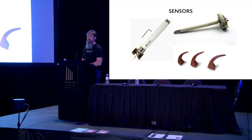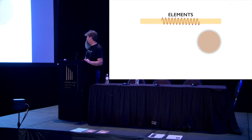And then, of course, we have cones. And cones, as a sensor, are extremely important, even when you're doing computer kilns. Because the cone is right. The cone will tell you what happened, provided you took care of the cones. The cone will tell you what actually happened in that kiln. And so you want to look at your firing, what happened, what happened, what happened. And it'll help you diagnose, do I have a thermocouple that's starting to go out? I can look at the cone. So it's a good sensor as well.